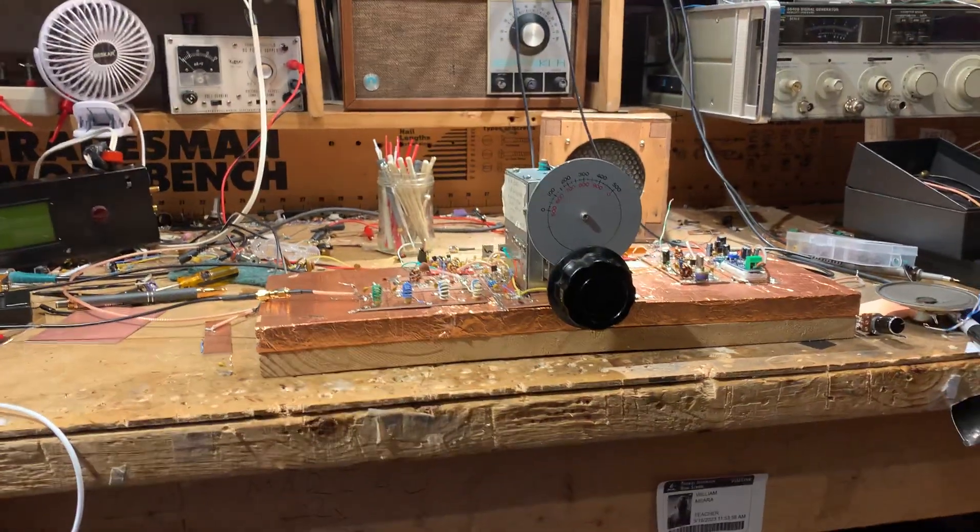You can see most of the receiver project is done. I found a speaker today on the Thomas Jefferson DC direct conversion receiver project, and I'm going to use that in this rig. I also found a little pot with a couple of shielded cables. This pot will go in here roughly, and that'll give me some front panel audio volume control for the receiver. Right now I have to reach up and change this little pot on the LM386 board, which is kind of unwieldy. I'm using a little speaker here — you can see the speaker line comes in, and it works out pretty well.